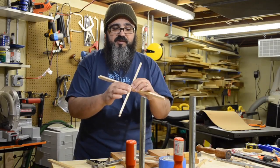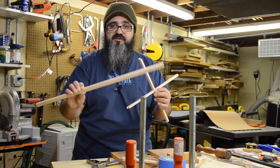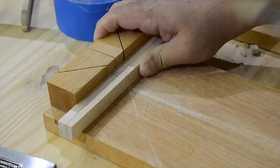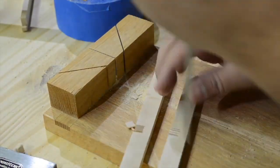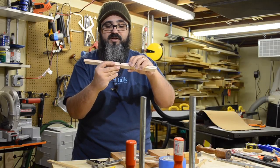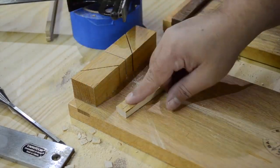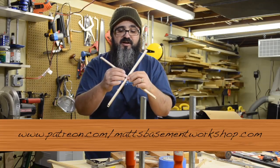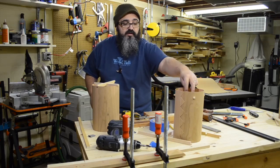On the inside of the lampshade, I have these crossbeams which will add rigidity to the lampshade and provide a place to hang the light from. Really simple to make — just scrap material cut to length, then we created a notch by ganging them up once we figured out approximately where the center was. We want to make sure they are inverted relative to each other; if both went the same way, the next step wouldn't work. We then created notches on the ends using a carcass saw, ganged them up, cut the notch, and cleared it out with a chisel to create a half-lap joint.